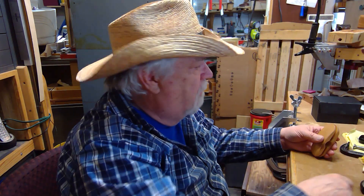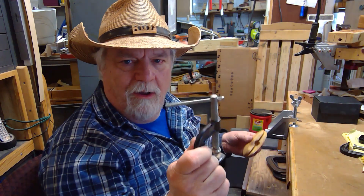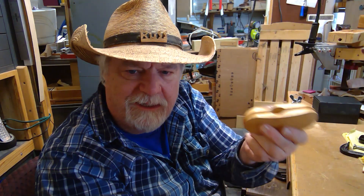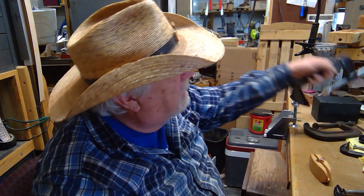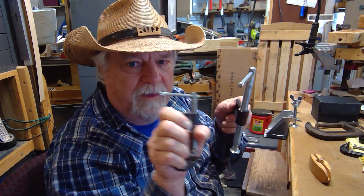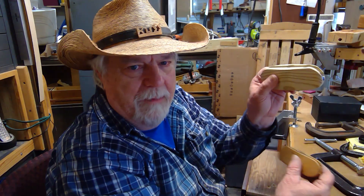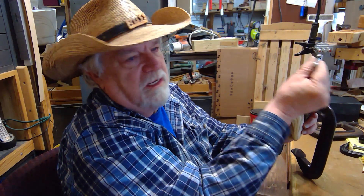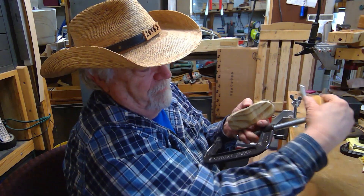When he asked me that question, it dawned on me — oh, I could use this on my little vises too. So I got my little vise out, put it on there, and went, oh look at that, works perfect. You can actually use this on those vises. Except, if I take this — this is a five-inch and a four-inch clamp — this is much bigger than the little one. So I decided we're going to have to make his big brother. Since I'm going to make his big brother, I can also make it better and bigger. So I made his big brother, just like this — it has the slot in it, but I made the slot wider so that it will fit over these, because the original slot just doesn't fit on the larger clamp.